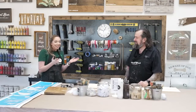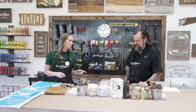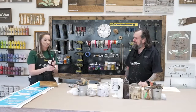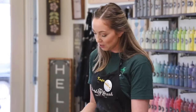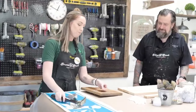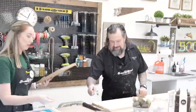We get to distress our wood — people are always surprised, but it's pretty awesome, especially on a Friday night. We distress ourselves, and we get to distress our wood. So why do we distress it? Just to give it more character — it doesn't look so fresh cut. First we have our hammer: use this end and you get a half-moon indent; use the side and you get two little claw marks. Then our meat tenderizer — it's actually one of my favorites — gives you little clusters of dots. And then my favorite is the chicken wire: place it on your board, use your hammer, and you get these little honeycomb clusters. There's no right way to do this.